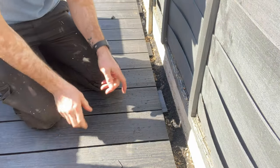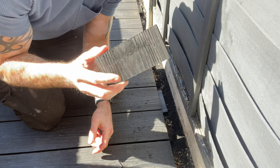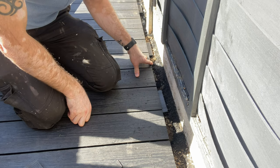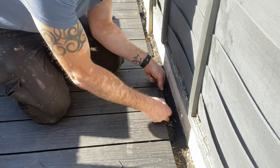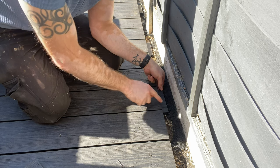I've got my 70mm bits cut — just an old bit of deck board. I'm leaving two spares between each one, so I'm working like that. I basically hover it in between through the centre — there's about three and a half centimetres either side. The spaces between the actual deck boards look like this, so I'm using that upside down as my spacer so I know the drill holes are exactly the same. I'm holding it about 10mm off the edge of the board — but I can keep it flush on this section, and I know exactly where my screw hole goes. Clever, isn't it?